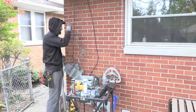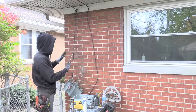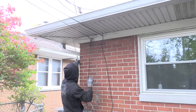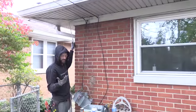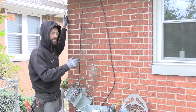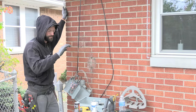Since I've got all the equipment removed, my anchor is the meter base. I'm going to set it directly under that existing hole because I don't want a second roof penetration. I'll mount the meter base underneath that hole, then put the trailer panel underneath the meter base. The trailer panel — a somewhat crusty name for a nice piece of equipment — is my service disconnect. It's got overcurrent protection and it's an eight-space, 16-circuit panel. So anything that needs power out back — hot tub, outdoor lights, irrigation, shed — can come right off this panel without penetrating the house every time.